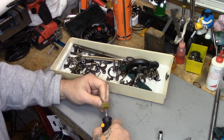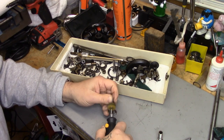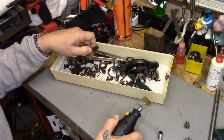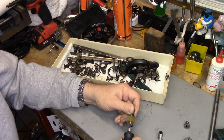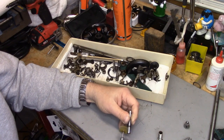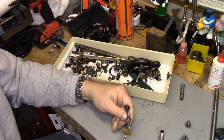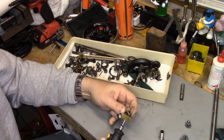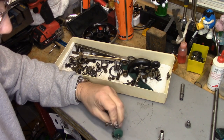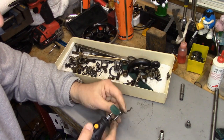We're going to start using the rotary tool with Scotch-Brite buffing and cleaning tools. The brown one — which is actually more of a yellowish color — is 120 grit. There's also a green at 180 grit, a red at 320, and a black at 400. These little rotary Scotch-Brites are great for getting crud off smaller parts. That's the needle bar bushing — you can see me getting a lot of the crud off. It'll eventually go to the buffing wheel and get cleaned and polished the rest of the way.